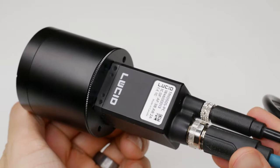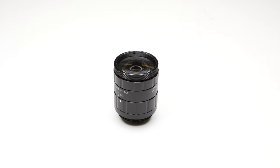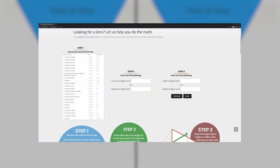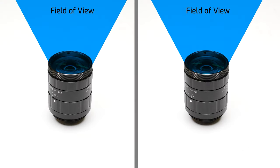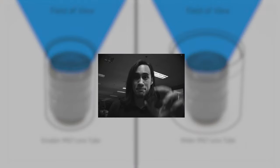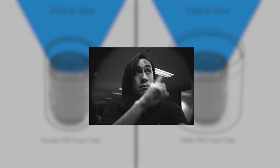But don't go just yet — we still need to talk about a few lens and lens tube considerations. One of the first things you need to consider is the field of view of the lens, as well as how that relates to your sensor size and your working distance. We have an online lens calculator that can help narrow down the focal length that you require. With respect to a lens, the wider your lens's field of view, the wider the IP67 lens tube needs to be. This is especially important for shorter focal lengths because they provide a wider field of view, and if you choose too small of a lens tube, you'll clip out some of the image or get vignetting.